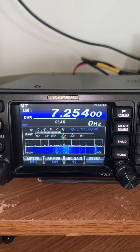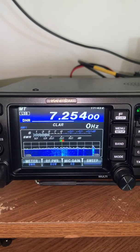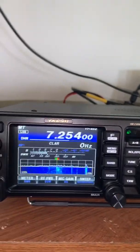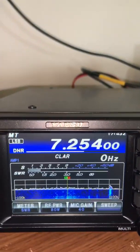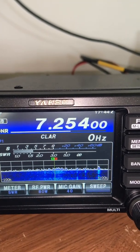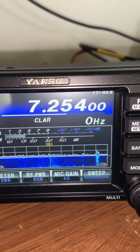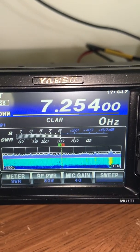It's a Parks on the Air station. I'm going to first turn on the TimeWave. Let's turn it off and on — you can watch the noise across the top of the waterfall go down when it's on and up when it's off. Now I'm going to adjust the noise phase to where it should make a difference. This is obviously a lot worse — wrong phase.